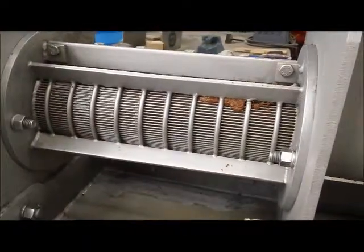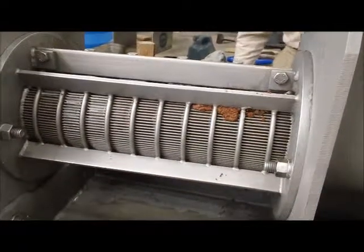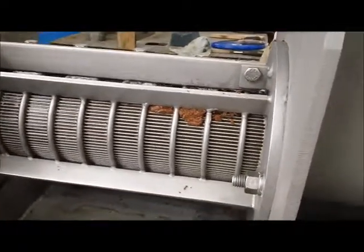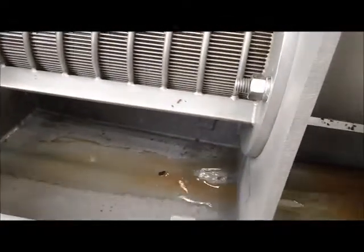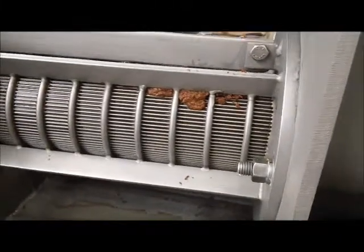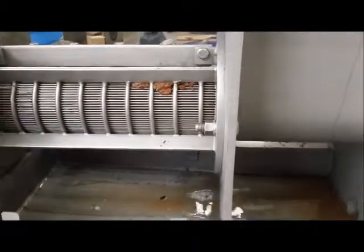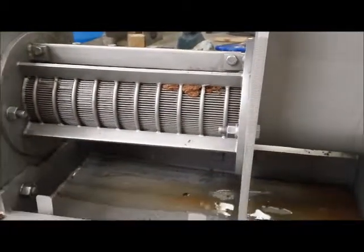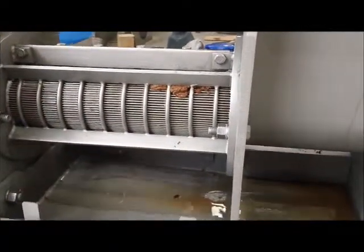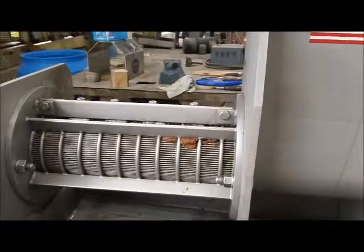If you see a lot of spitting, it indicates that the screen is blinding over and then unblinding momentarily, and you're getting a shot of liquid coming through. I'm at 30 PSI — I'm reluctant to go higher for fear of getting false results. Do you want to try reversing, Bob? Let's see if it improves the liquid flow, just to confirm the blinding observation.